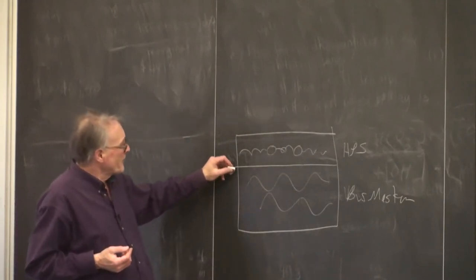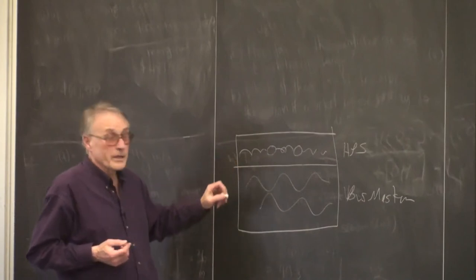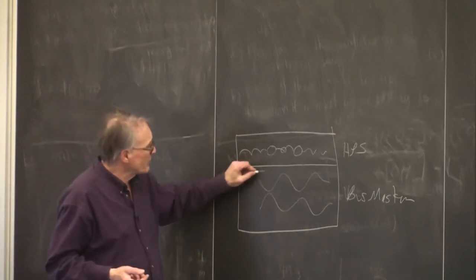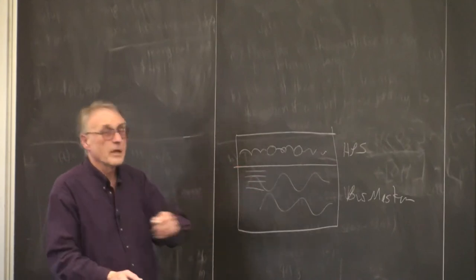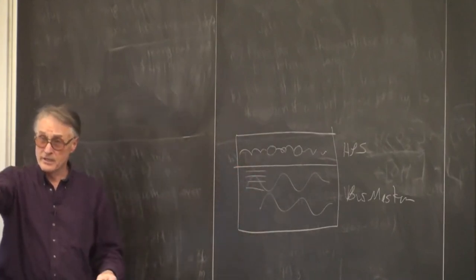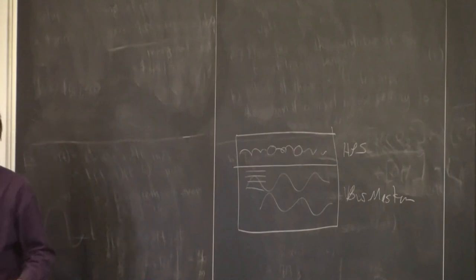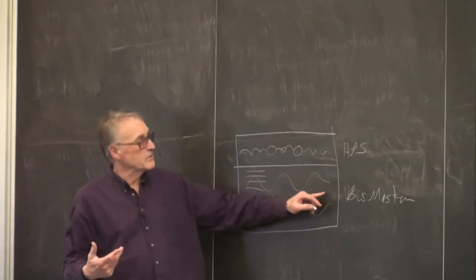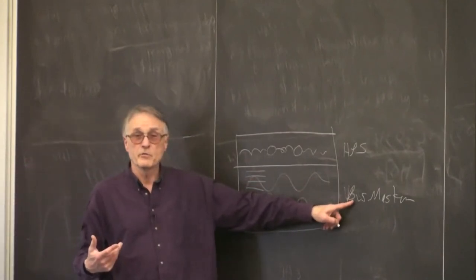But what you will find out is that it's quite useful for debugging and for setting parameters to be able to put text on the screen. And that will be handled by the HPS. So the text generator will be manipulated by the HPS, and the graphics planes will be handled by the bus master that you write.